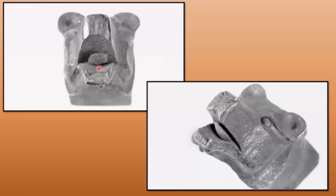And then what I'm going to do is I'm going to use the same tool. And if you can see, if I split this material in the center of the jaw here, you can see I've come from about the center of the material and cut, and I'm going to cut left and right. And I've lifted up enough material here to start making my incisor. I've still left a sort of dome of material here that will be the teeth.